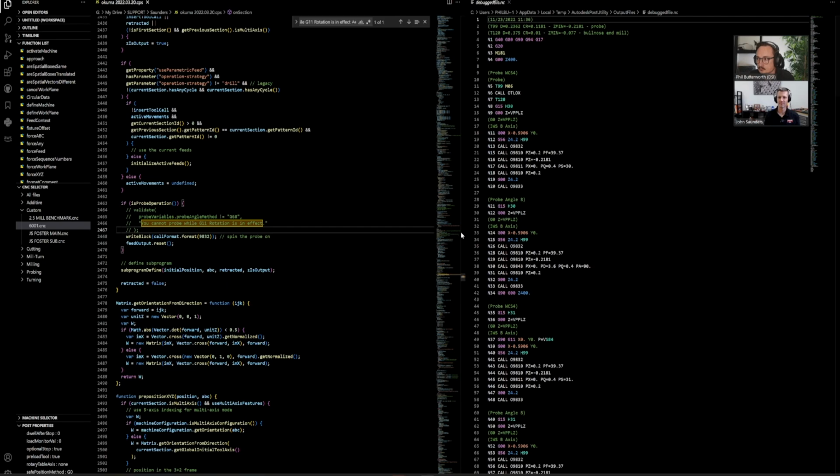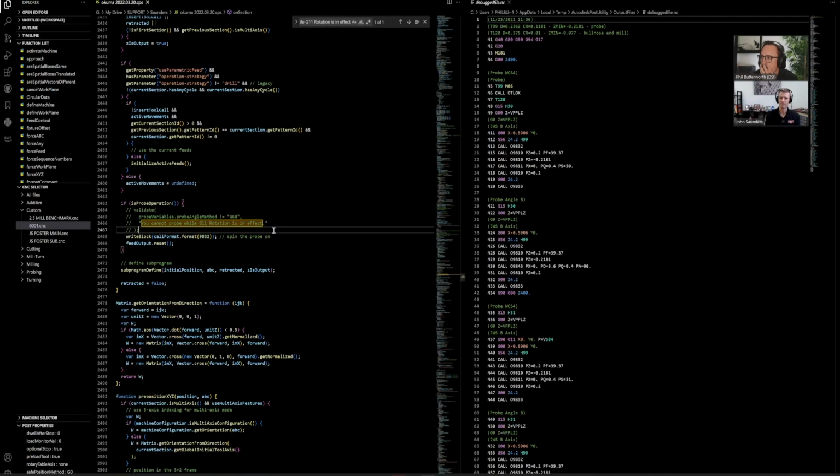I'm not sure, but, well, that was my layman's frustration. It should probe the angle. When it probes the angle, it would turn on G11. That would let it work in that shifted plane mode to cut the 2D contour, and then it should turn it off, which means it should be fine to move to a new coordinate system or probe. I know you can't activate a probe and run probing cycles when you're already in a G11, but it shouldn't be. So as a layman, it should be easy to look through this to make sure it's applying the G11 and then turning it off before it moves on, right? You should, yeah.